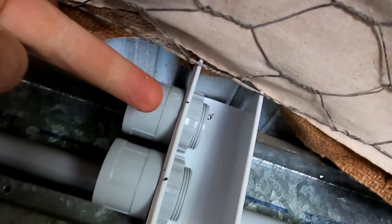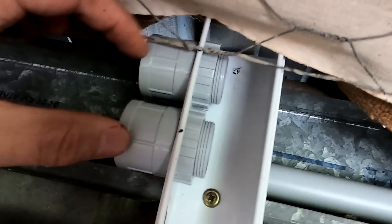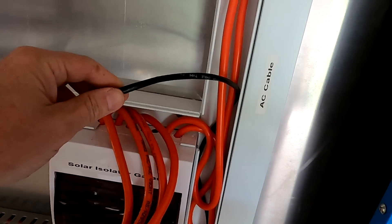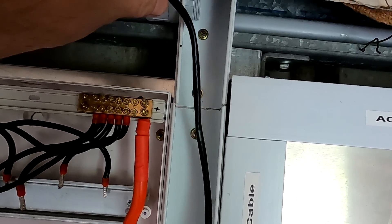My friends, this is my solution. I just extended the cable duct and drilled a couple of holes in here for these glands. Now we can connect this conduit here nicely to these glands, and we've got a seamless connection and protection of the cables going into this duct. I only have two of them in stock, so hopefully the electrician has one — of course they have one. The only problem now is we have to disconnect all these cables from our isolator. I'm not going to do this right now because I can do one but not both, because we are still charging from the west roof. Oh, I've forgotten about the network cable — there's always something.